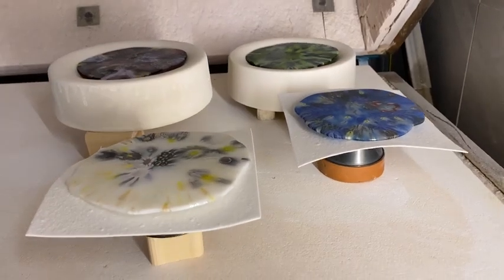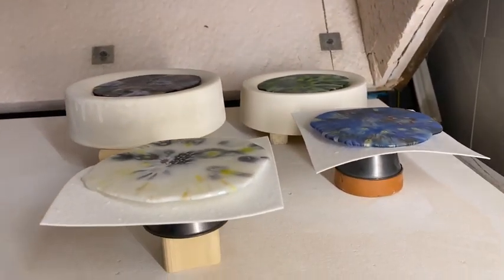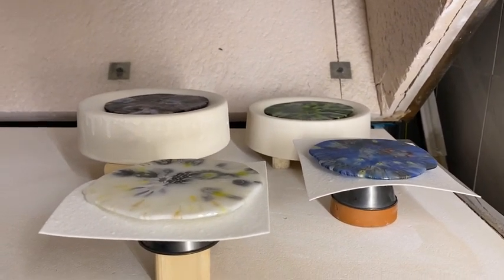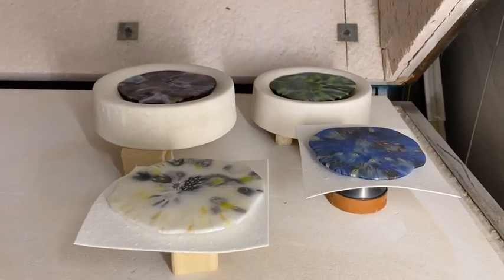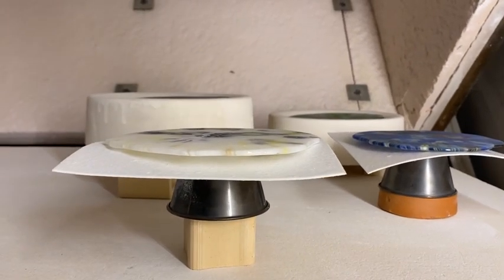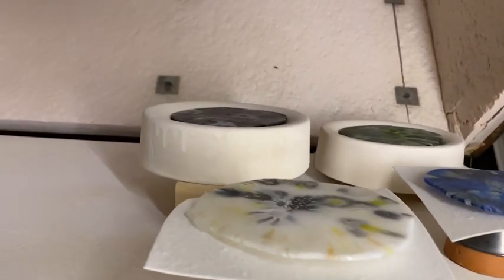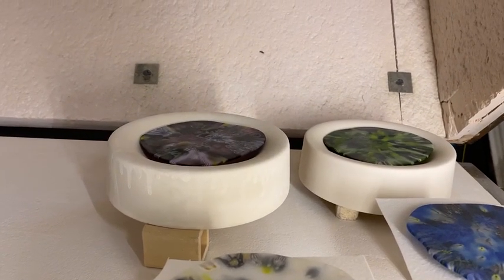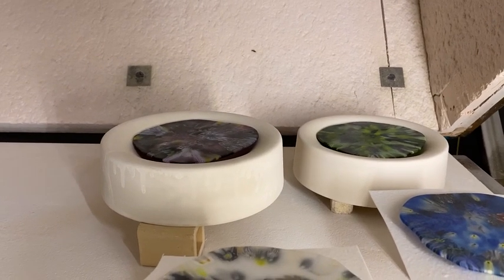Here's my set up in the kiln — I'm doing two draping and two slumping. Now you shouldn't really do draping and slumping together; I'm probably going to have to go hotter for the draping than slumping, so I will probably do them separately in my smaller kilns, but I just wanted to show you how they would be set up. I put these on kiln posts because the pots weren't going to be quite big enough to drape over. I will also put a spirit level on to check that the levels are flat before slumping, because if the levels aren't flat in your kiln, your glass may not slump even in your moulds.